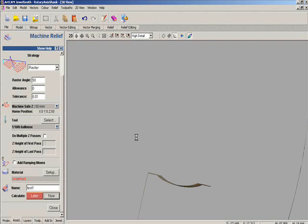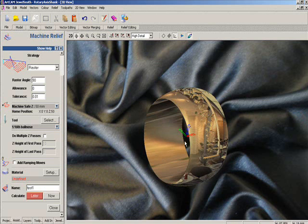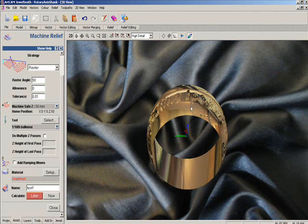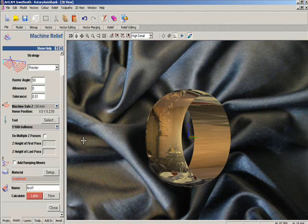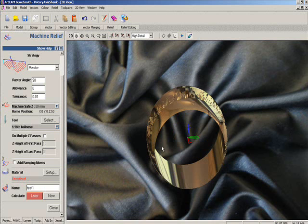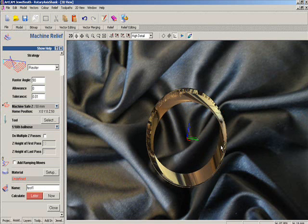You can see it starts from the bottom. Let's go ahead and restart so we can see. When the wax is on the machine, this right here is A0, and this down here is A180. As you can see by our orientation marks, Z0 is in the center line, Y is in the center line front to back, and X is in the center line left to right — actually this would be X, this is Y, and this is Z.